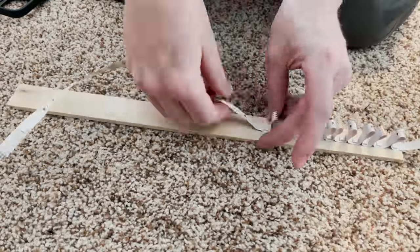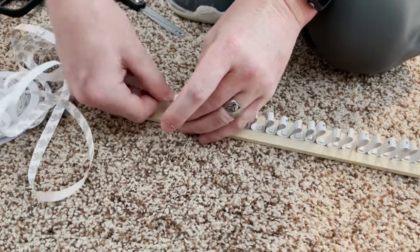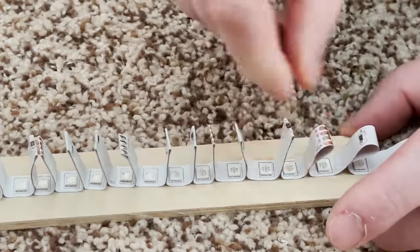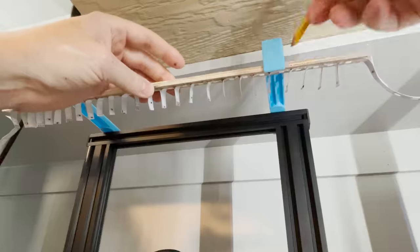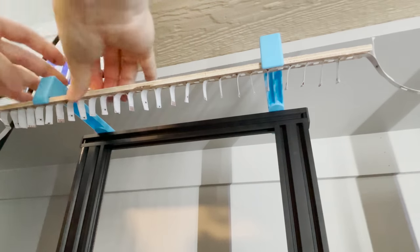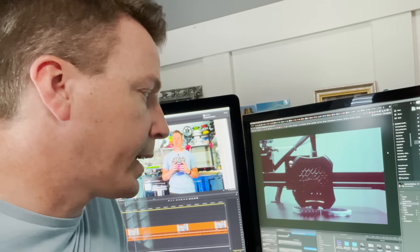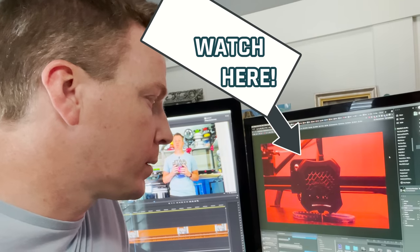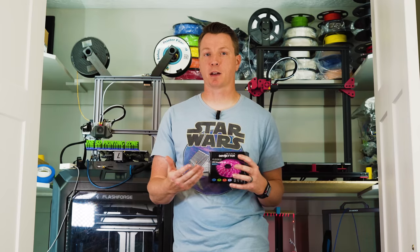These particular lights are perfect for doing little light bars. I use the 3M adhesive on the back to place them on a strip of wood, aluminum, or even a 3D printed bar. Then I use the spacing between them to pinch and fold them up a little bit, which creates basically directional lighting. Because these are smart lights, I've got them set up with both Google Home and Amazon Alexa, so I can control them in the app, with a remote, or using my voice.